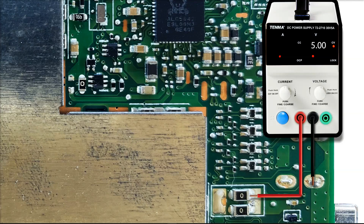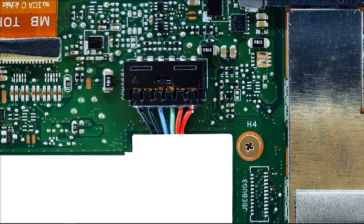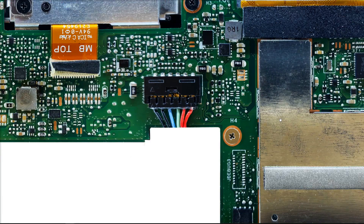With that capacitor removed from the board, I once again injected voltage, and this time I found that it was only drawing 40 milliamps. I'm not exactly sure what this is meant to be, but it's certainly not meant to be half an amp when it's not even powered on — so the short is gone. After a period of time, that 40 milliamps went up to 400 milliamps, and I checked the battery at the connector, and I could see it was getting up to 3.6 volts. So it looks like the short is gone and the battery is charging — previously it was down at 0 volts.